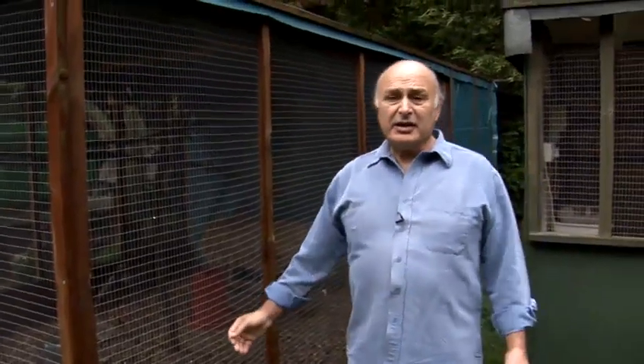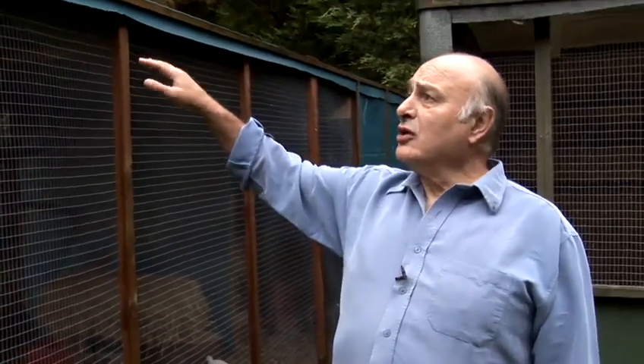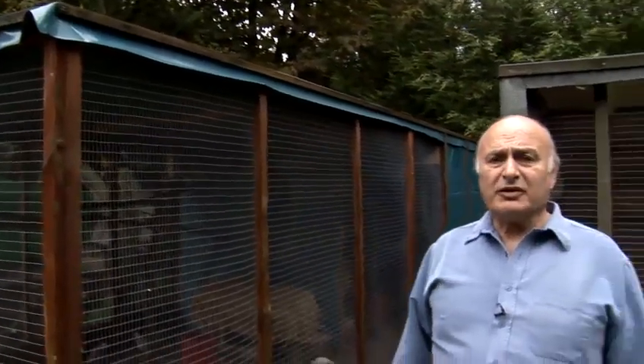You make up as many panels as you need and when all your panels are ready, then you screw them together and the enclosure is ready. You have to make sure that your top section is done with a slope so that when it rains or when there is snow, it falls down to the floor, because otherwise all the snow and water accumulates over the top of the aviary and with the weight can break the aviary.